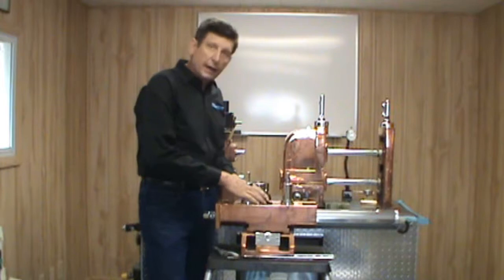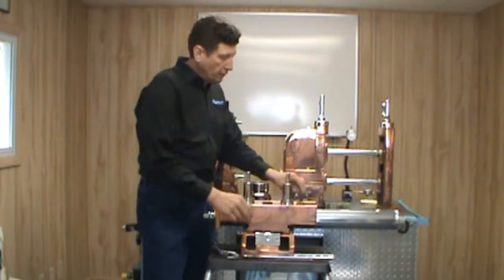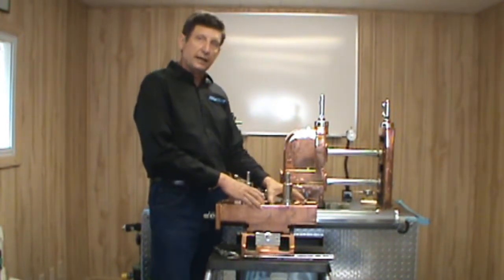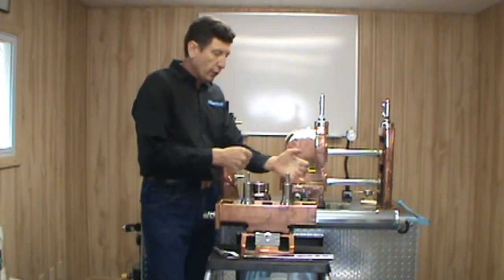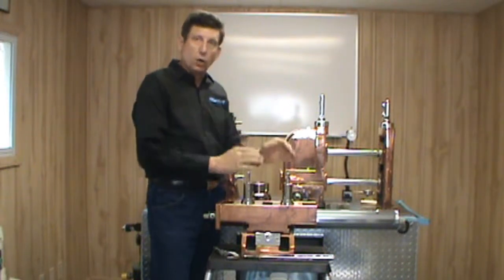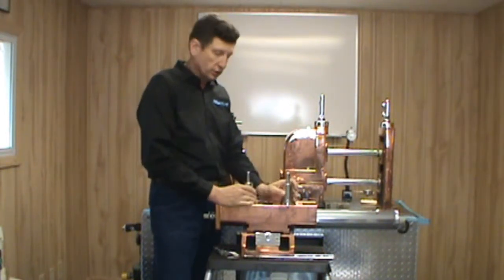The next thing to check is the block itself. How are the blocks held in? Are they held in with top gibs, or with keyways like this particular stand? Whichever method of design, make sure the blocks are nice and solid. We don't want the shafts to be able to rock and roll, because loose components like that will prevent us from holding the side pass rolls parallel.